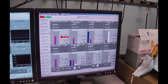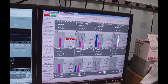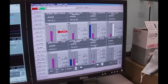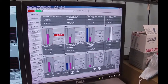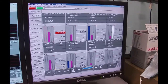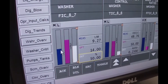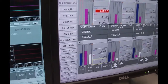So I'm going to go into washer controls. As we mentioned before, this is running a total warm water flow and cold water part flow — this is actually a part-to-total ratio control. The temperature controller actually sets a ratio setpoint. FFIC-89 is really just a multiplier. I'm going to start up on manual and manually open the valve to 50%. This valve is going to go to 50%, and you might hear in the background water dribbling down through the tank. I've got a setpoint of about 14 liters per minute set on there for lots of flushing flow.